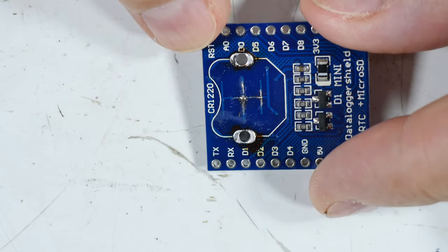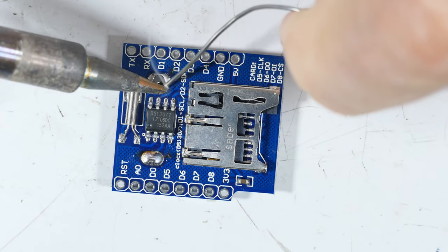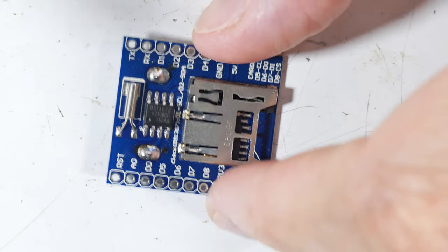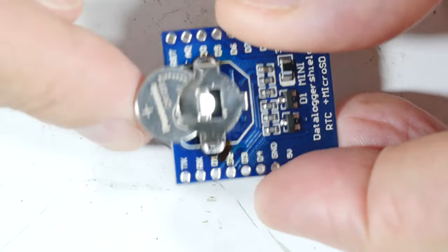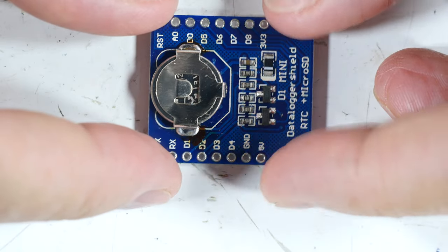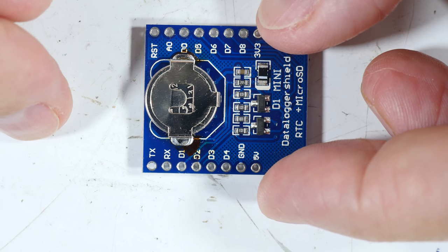Sheer probability — the battery is going to touch that more easily. Now all we have left to do is replace this. I will finish up by soldering in the pin headers and then place the battery and all will be good. Much tighter fit. That was it for fixing these button-type battery holders that may not have a good contact. Hope you found that useful and interesting in your home electronic projects.